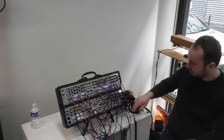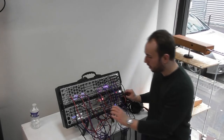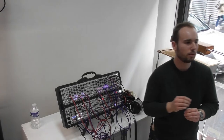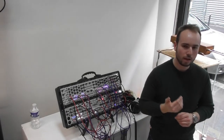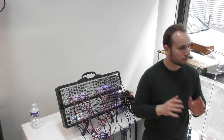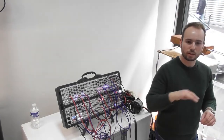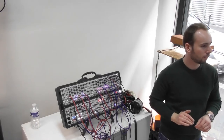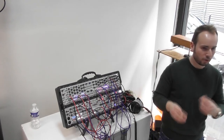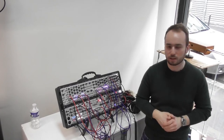A little patch I've created through Step 8. The idea behind the module is I realized that if you look at a lot of sequential modules, and with that I mean analog sequencers, sequential switches, analog shift registers, everything in that genre, they have quite a bit in common, but they are different variations on the same theme, with slightly different circuitry. And I wanted to create a more general building block where you can patch up all of these things from a single module.